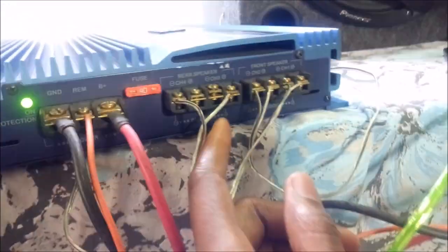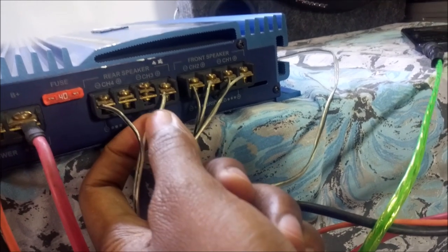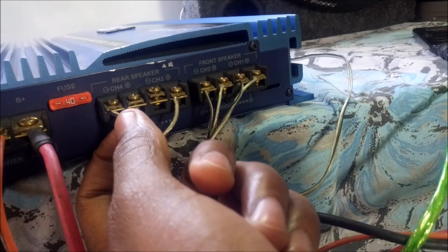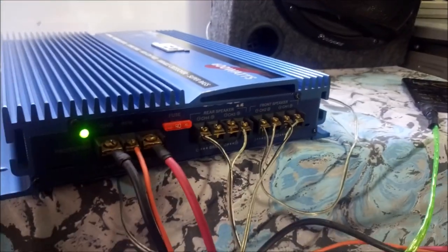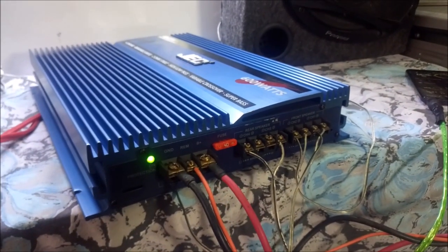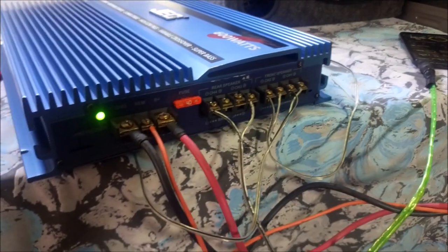So my bass speaker is connected over here. I'm using the whole range of ports, the positive on the extreme side of channel 3 and the negative on channel 4. This is how you are supposed to bridge. So this cable goes to my subwoofer down here. That's the most basic function you can use with the amplifier as a beginner. In the next videos I'll show you how to add more speakers over here and how to play with the impedance.